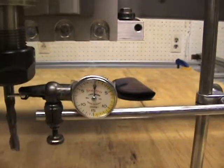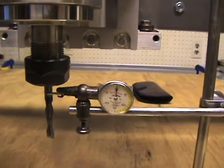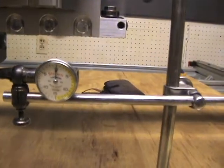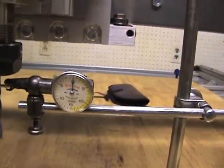As you can see, there's hardly any movement whatsoever. My TIR with the tool in the collet in the spindle is less than two tenths. Each line on that indicator is five tenths, and it barely even moves — probably not even a tenth by the looks of it.